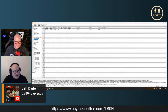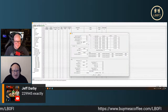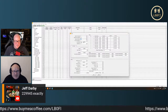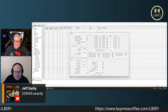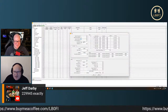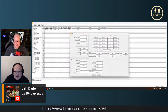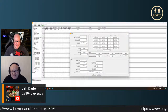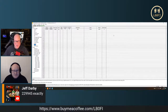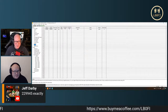Yeah, absolutely. This radio has limited APRS, which is manual or analog APRS. And in here, you actually have to tell it to use the moving beacon, otherwise it will place you in China. So if you look at my APRS position, I have not been in China, but the radio sent it at one time. And APRS on Anytone is not a good option. It does work at times, but it's not a good solution, and it's only TX for location. Yeah, and that's what I've figured out with that radio as well. I've tried APRS on it a couple of times, and it sometimes works and it sometimes doesn't. And I haven't really figured out how to make it work every time.